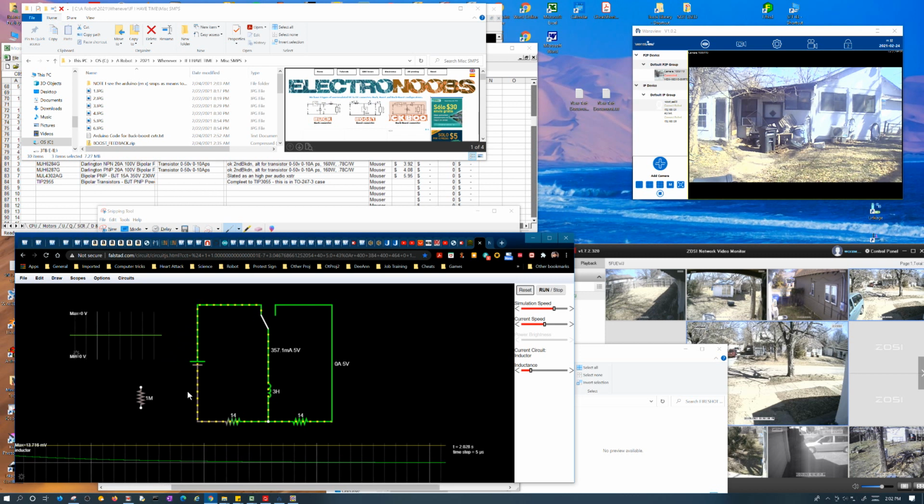So an MRI magnet is not hooked to electricity. It's always on because it's a superconductor. And they can't turn it off because the damn thing will explode, because it's got so much energy stored in it. If the circuit it's in all of a sudden gained resistance, you've got kind of a bomb on your hands. It goes from not seeing any resistance to suddenly seeing a bunch of resistance, and you've got a lot of current flowing in there to generate an intense magnetic field like that. So, voila, you just blew up.